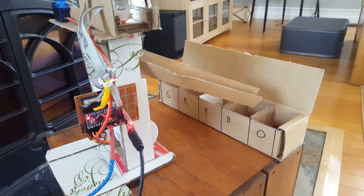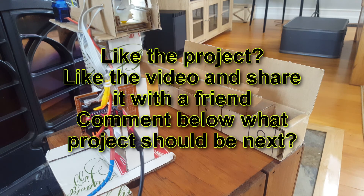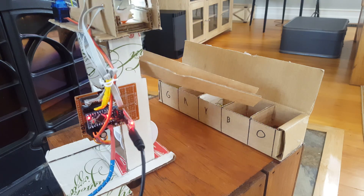I made my own custom circuit board to save space and to practice soldering small surface mount parts, like the SMD voltage regulator on the back. It isn't the prettiest thing, but it does work. I made it use a standard USB plug so I can plug it into any portable power bank and bring it along anywhere.